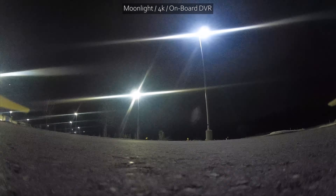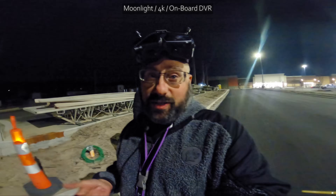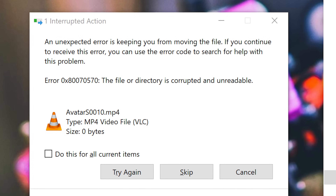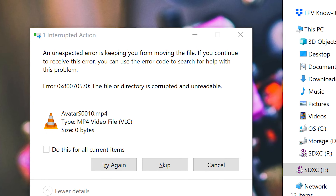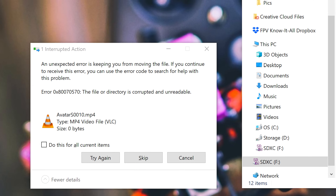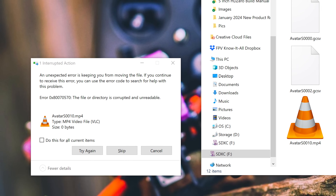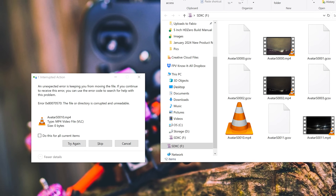Now it's time for another check because I just killed my battery — a good test of whether it saves the footage if you run the battery dead. The file is corrupted and was completely unrecoverable. This is as compared to the DJI O3, where if you lose power during a recording, there will be a corrupted video file on your SD card, but the next time you power up, the O3 will repair it and you get everything up to the moment you lost power. Granted, this was me running the battery all the way down to 1 volt, but it seems like if you lose power it just corrupts the file. That's room for improvement, Walksnail — it's kind of a big deal if somebody's going to be using this for professional 4K use.